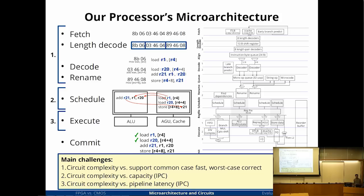Yes. So you can't avoid it, but there are things like I will try and reduce the size. I will not put the data in the CAM. You can avoid it. They're just convenient. I have seen some papers where you avoid it, but you pay an IPC, and it's also really hard to design, and not quite worth the effort.